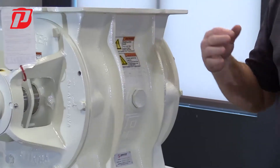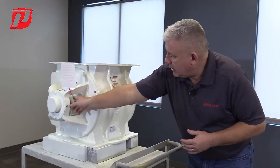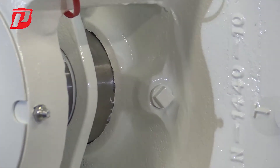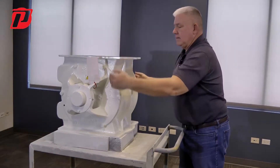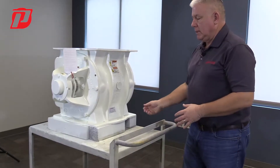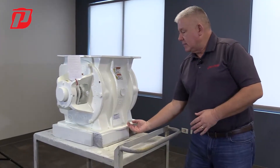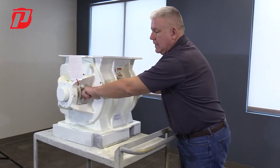You run clean shop air to that air purge kit. That air then runs to the right here — you can see the fitting. And what that does, it blows air into the lantern rings, which then blows air into the bore of the housing from both sides. So as that pressure from below is blowing the product, and the pressure of course is trying to find the path of least resistance, it's going to try to come up through the airlock and come out through the seals here.